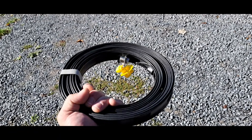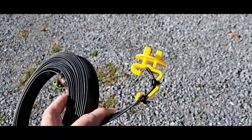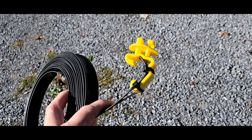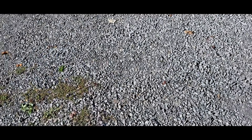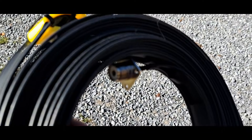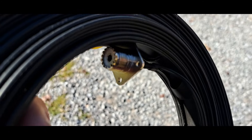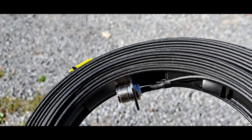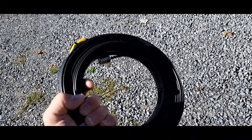That's 35 plus feet of wire and it just rolls up nicely and holds its shape. We're going to tie the paracord to this little insulator — just a cheap 20-cent electric fence insulator from Tractor Supply or somewhere like that, and that does a sufficient job. You can see the SO239 connector; it's just soldered in. The little holes on it are where I clip my radials for the outer part. Nothing extravagant — no balun or anything like that, so we don't have to deal with any loss from that.